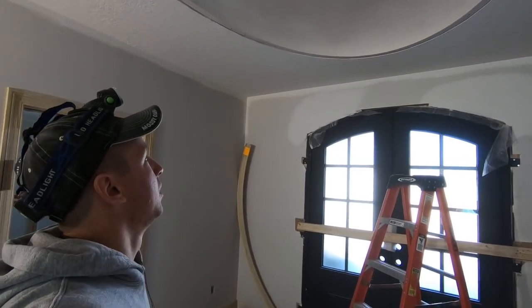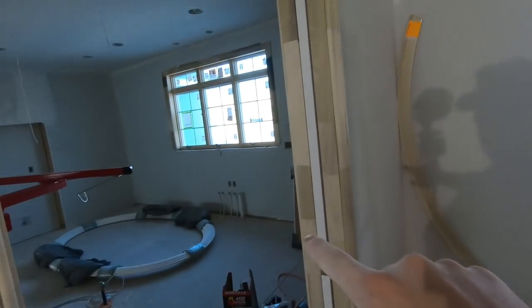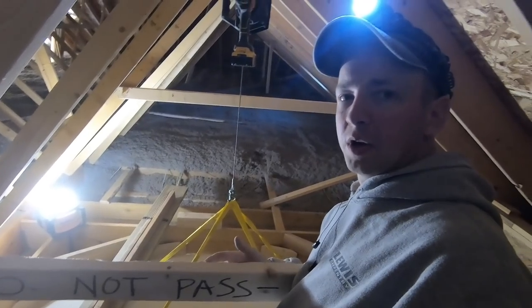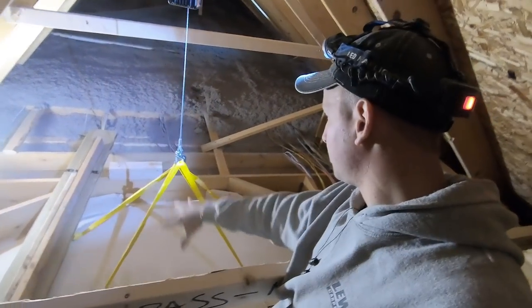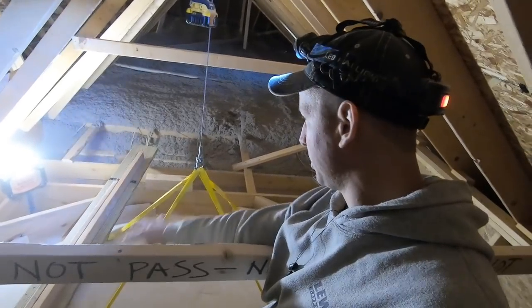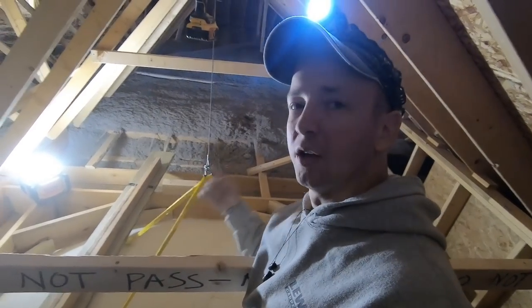Time to take a peek at what it looks like from the underside. The dome is all installed and screwed to the framing. You'll notice I did overcut the drywall a little bit around the ring — that was intentional, as it'll all be covered by the crown ring that gets installed over it. Overcutting was a lot easier than getting it up there and having it not fit. Back up in the attic, the manufacturer specs some tie wire — I think they want those points wired to framing to help support the center section. I'm going to run to the hardware store, get that done, then get this plank adjusted over the center for the electrician and start thinking about how to get the crown piece installed around the perimeter below.